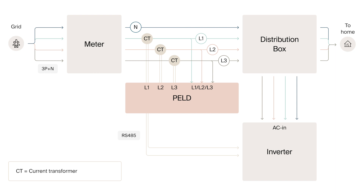The CTs should be installed just behind the customer's main switch. Switch off the main switch and disassemble the line cable. Now place the wires of the CT clamps in the connectors. Make sure all are wired similarly with respect to plus and minus.